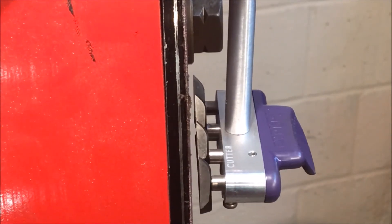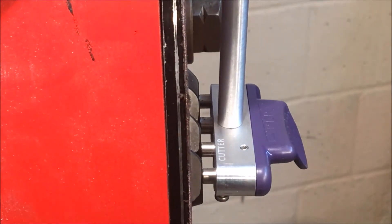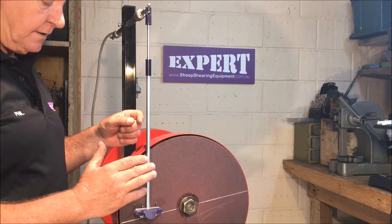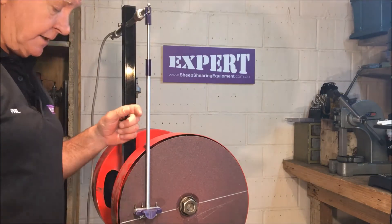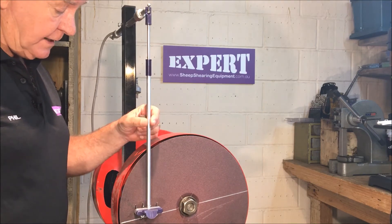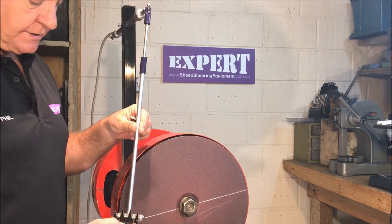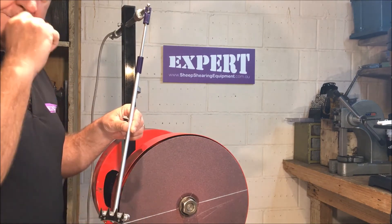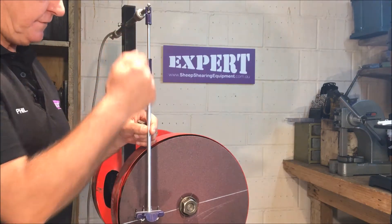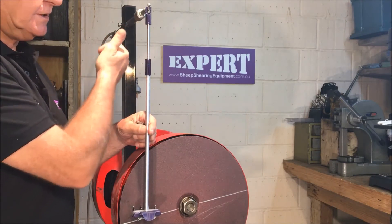After a little bit of fiddling around it looks good. Now that we've got the cutter hitting the emery flat — adjusted by eye — to check that you've got it 100% right, grab the pendulum very lightly and just wipe the cutter over the emery. You'll see rub marks on the face of the cutter showing where it's hit the emery. If it's rubbing too much to the heel, we need to shift the grinder in a bit. If it's grinding too much at the tips, we've shifted it too far in and need to shift it out.